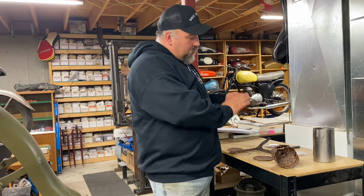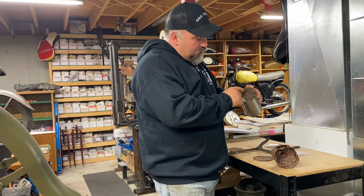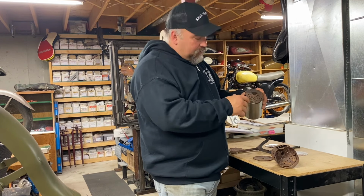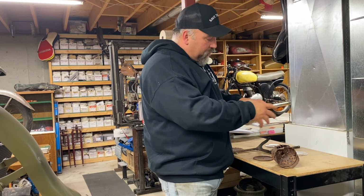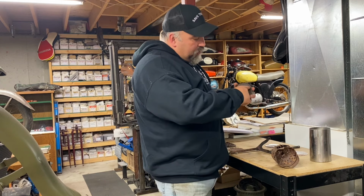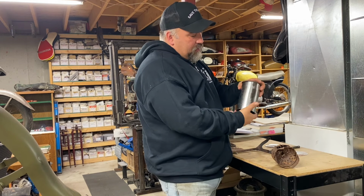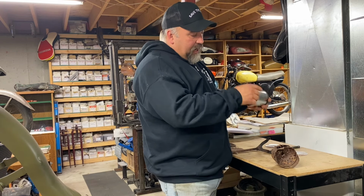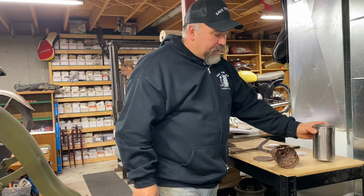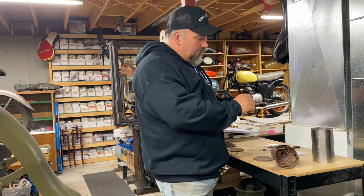And one more cone, this is the outside of the other half of the muffler. And it's got serrations on the, for the exhaust to exhaust out of the muffler. And that's forward. So we're about halfway there, and I need to get some material so I can machine it to this inside diameter. So when I fold it over, it's perfect, because this fits over really nice. And I need that same diameter, but something stronger. I don't want to try and fold it over onto the muffler canister and damage it. And then we have to get this nut off so we can get this piece off and probably replicate it.